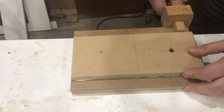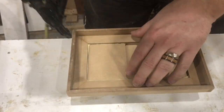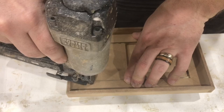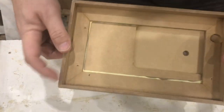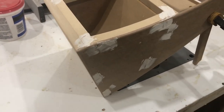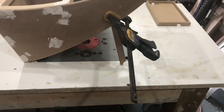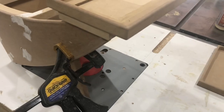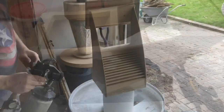With all that done, the build for the bottom portion of this project is finished. I've got to go back to the top where the monitor or the tablet is being attached. What I've done is cut another piece of MDF that's just a little bit bigger than the hole. You can see the picture frame again — there was a big hole in the middle, and I put a piece of MDF underneath that. I wanted that gap to allow for the wire that the tablet is going to use — I also routed out a little depth area right there to make sure I had lots of room for the wire.